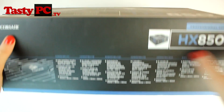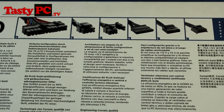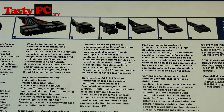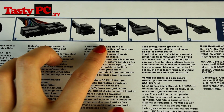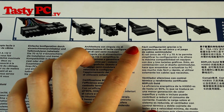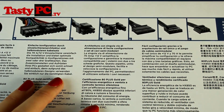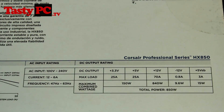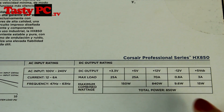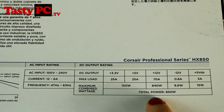If I show you the back of the box and zoom in a little bit — with this power supply you get the 24 pin and 8 pin motherboard connectors, 6 PCIe cables, 12 SATA connectors, 12 Molex connectors, and 2 floppy cables. Moving on to output rating, you can see that this power supply has got a massive 70 amps and 840 watts available to the plus 12 volt rail.